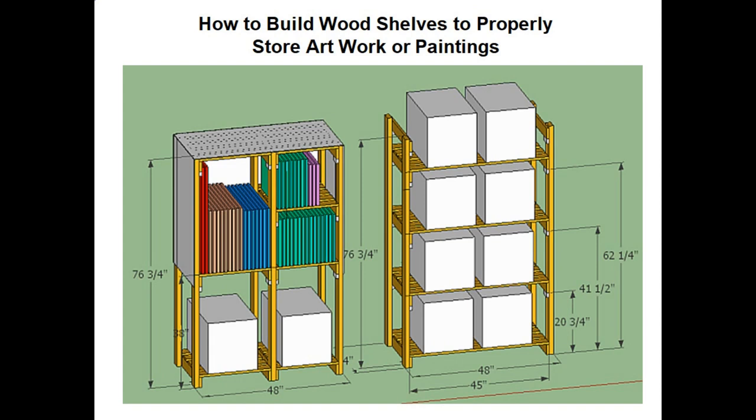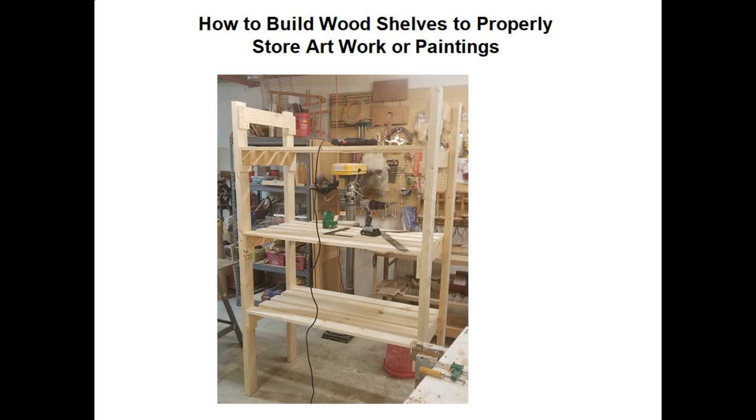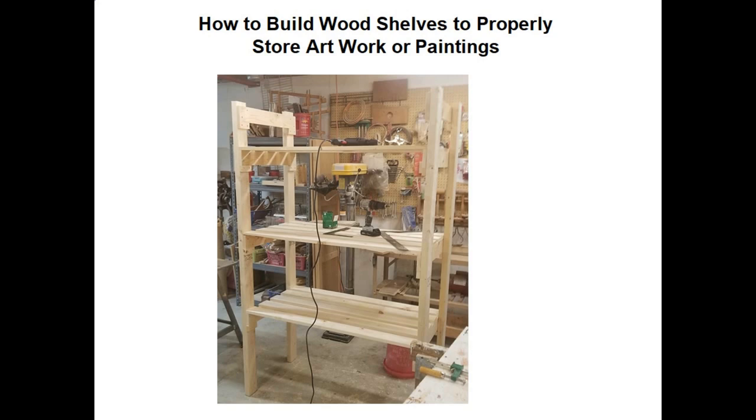The next thing on this project was to build the second set of shelves, which are intended to hold the plastic storage totes in the storage room — you can see the overall dimensions here. Here's the second shelving storage unit built up in my Fairbury workshop. If you ever build shelves or workbenches that are freestanding, one amazing thing you learn is that if you attach that shelf to just one place on the wall, it goes from being very shaky and wobbly to very solid. So it really only takes one attachment point. On this second shelf you can see in the middle back that I made a little curved piece that screwed into the shelf itself, then put a piece of scrap 2x4 across a couple of old 2x4s, screwed them in, then screwed the shelf to that board, making it very rigid and stable.